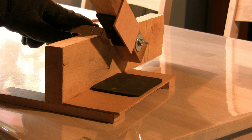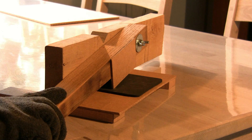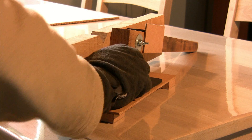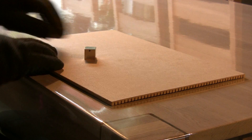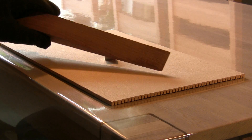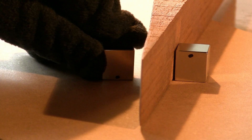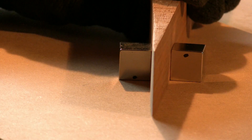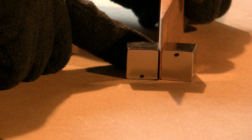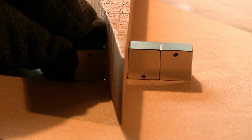Let's build a checkerboard. Take the first magnet off the stack using a splitter tool. Put the magnet on the locking board with one of the pole surfaces pointing upwards. For the next magnet you need a large wedge to slide the two magnets safely together. Remember to turn the next magnet upside down so you've got opposite poles attracting each other. I will make a 3x3 pattern so let me just put another one on — mind the poles.